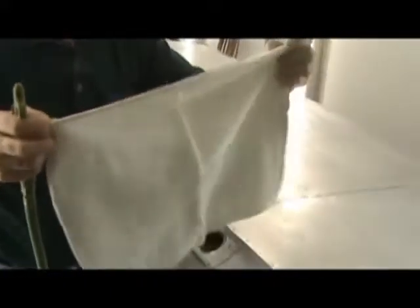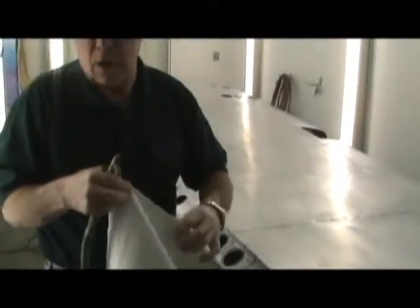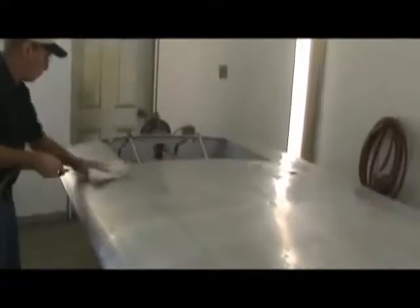The towel we're using is the same 18-inch terry towel — it's new and never been used, so it's not contaminated. This is the only thing we're going to wipe this wing down with prior to putting the primer on it. Okay, that's got the wing blown off — let's go inside the mixing room and mix the primer and start spraying.